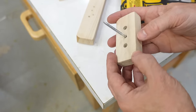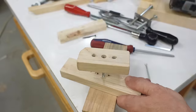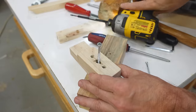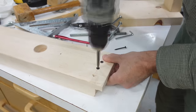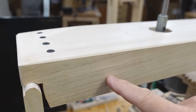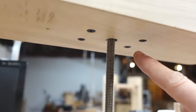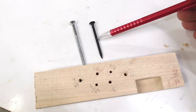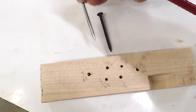Now, how do I get that sunken screw back out? I've got an idea here. These four drywall screws should provide more than a ton of reinforcement against splitting right here. But then I thought maybe this hole might pop out the bottom, so I added four more drywall screws here. Now, it is a bit of a mystery why this smaller drywall screw held better than the slightly larger countersink screw. So I figured it must have been the pilot hole.